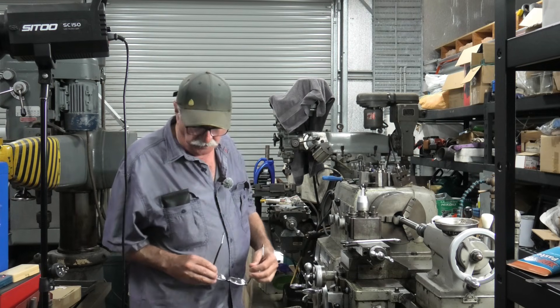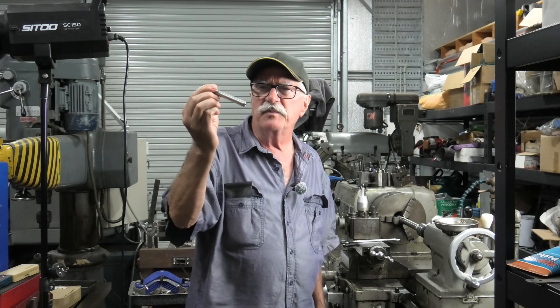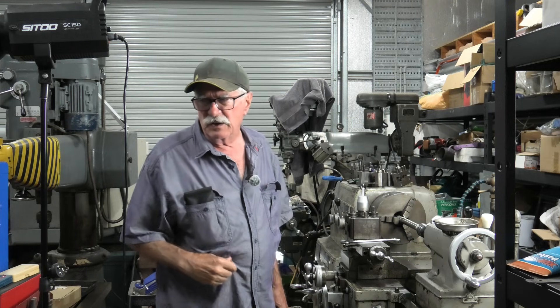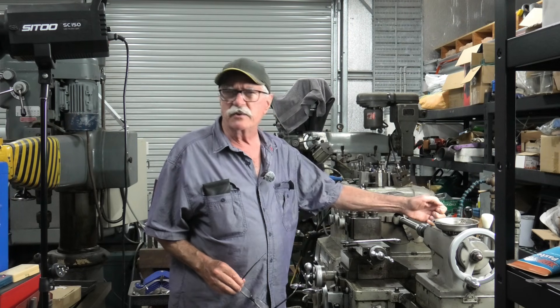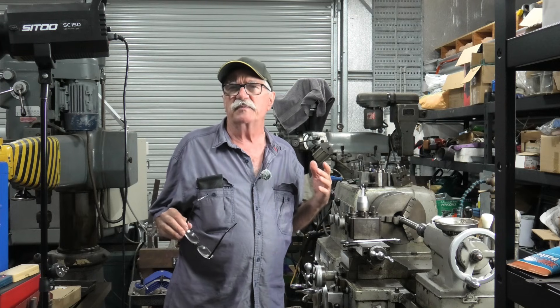I've been making a few pins for the riding car - just simple plain turning jobs - and they're not coming out as good as I would like. They'll do for a model train; there's about three one-hundredths of taper or whatever, but I'd like to be able to turn a little bit better than that. I think the live center might be moving a bit - maybe there's wear in the quill bush in the tailstock - and this is the sort of thing I'm trying to find out today. All your experience, guys, please throw your two bob's worth in.